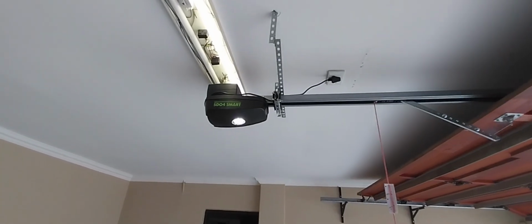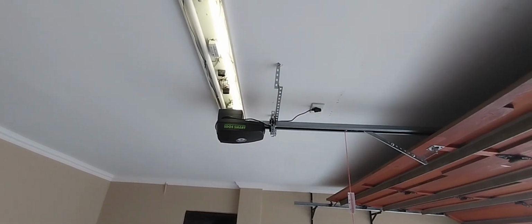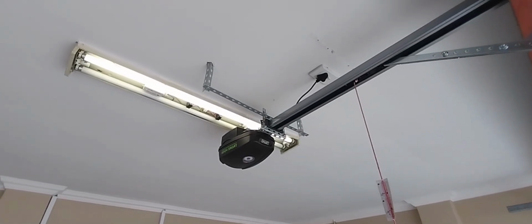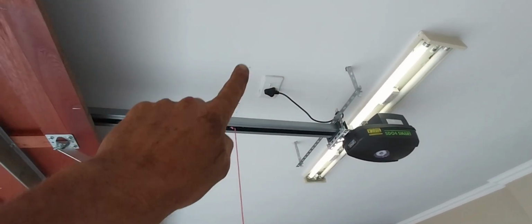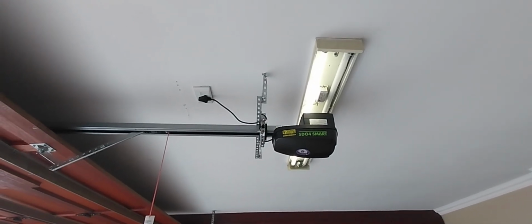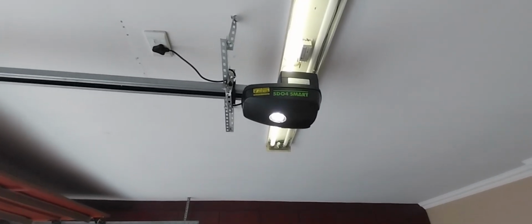Right, we're done with the SD04 Smart T12 sectional garage door motor. The brackets, we had to go through the ceiling. The previous brackets were on the brandering, so the client's whole garage ceiling was being pulled down. If you quickly look where the old garage door motor was connected up and where we connected it up through the ceiling onto the struts. Right, let's quickly test it. Again, if you look at it, you'll see that there's no vibration coming from the garage door motor.